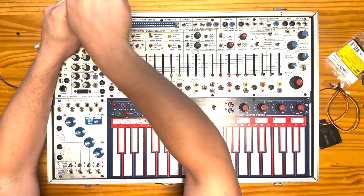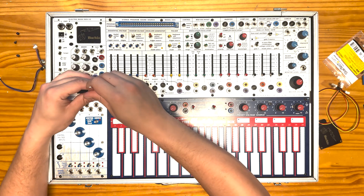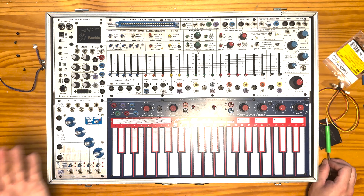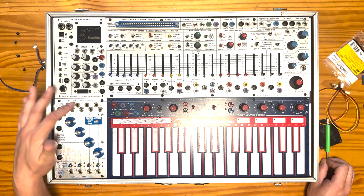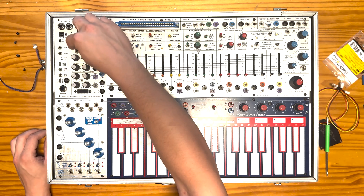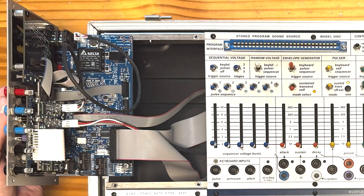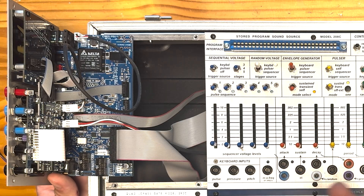It's just these four Phillips screws, and we're going to have to remove the light box temporarily from the MBO. Just while we're here, I also have a 292C Classic in my extra module slot. That's what I'm currently using to do stereo panning, because you can send an audio signal into two channels of it and then modify the amplitude of the signal on left and right and then go into these inserts. So we'll talk about applications for this mod. Let's remove the MBO very gently — you can actually place it on its side because of the PCB backer board here protecting the back of the PCB. You can see there's a lot of unused connections; the MBO was intended to be modded.